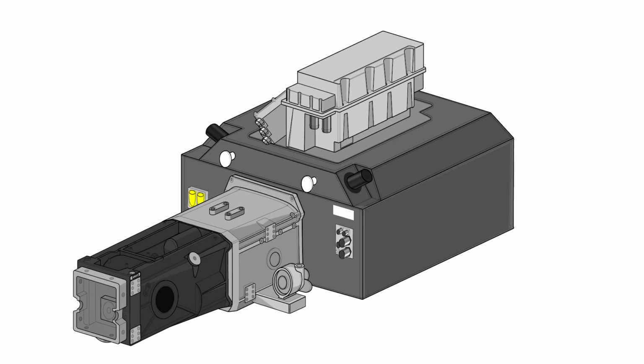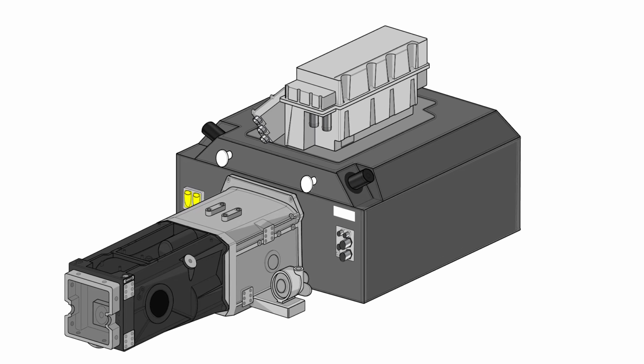And what type of battery is it? So inside here, we call it the battery, but it's a battery within a battery. Right. Inside here, you've got lithium-ion cells, very much like mobile phone battery technology, but these are pouch cells. They're about an A4 silver pouch, and there's about 200 to 300 of them inside, individually cooled, individually managed by an internal battery management system. Very, very clever piece of technology, but all you see is the carbon fibre box.